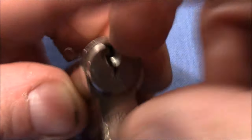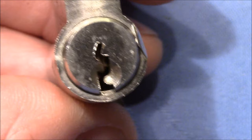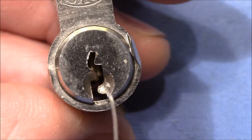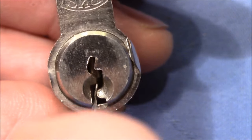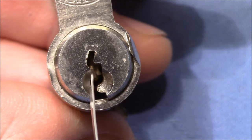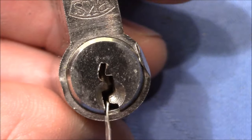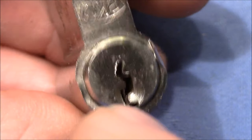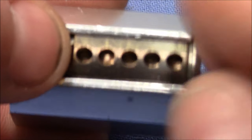It's a BKS by the way. This lock has a very paracentric keyway, which means that there is no straight line from the end of the keyway to the pins. We have this warding here. When you want to access the pins from the end of this keyway, you need to use the little hole in each piece of warding, and you need to have a very thin and flexible pick — you cannot apply a lot of force to the pins.